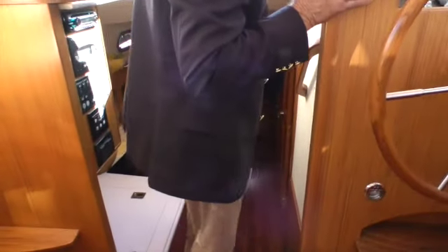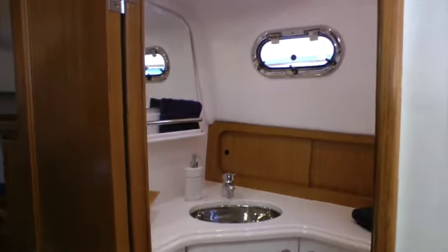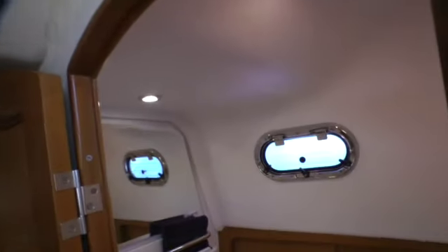The companionway steps — there were several ways that we could have done them. We chose to build them wide: they're about an inch and a quarter wider than normal at the center point, and they taper to the side for a little bit of style but a little more footprint as you come down. We chose highly figured wood for them because they're focal points as you look at the boat. Whereas on the sides of a flat panel wall you wouldn't do that, because a highly figured wood would make your eyes get funny — you'd instead do book matching of your grains.